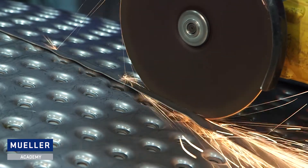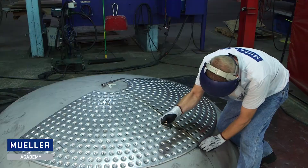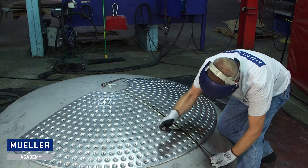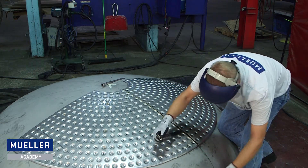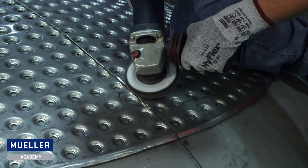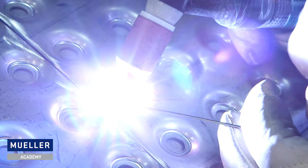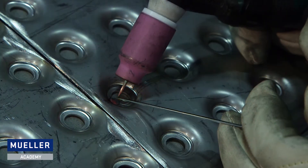Using a cutoff wheel, trim along the line, cutting through both pieces of dimple. After removing your scrap, you're ready to deburr the edges and prep for welding. After you've made your trim, you're ready to tack your second piece down flat against the head all the way out to the edges.